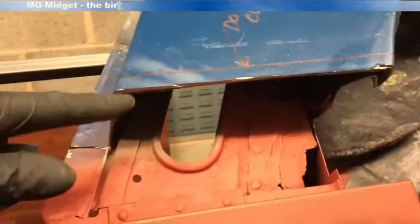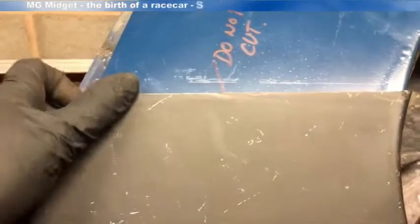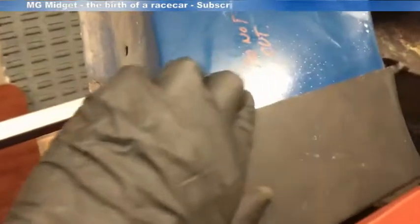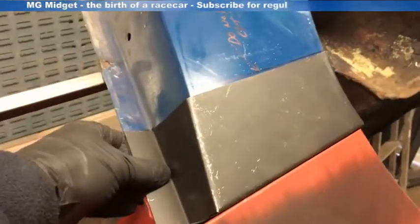Around the back end there's quite a big hole left here, so we're going to have to do a patch repair to remake the inside and seal that up. I've also noticed there's a bit of filler on this panel here, so I'm going to linish this back, and then this metal will sit on top of the metal underneath on the wing. I'm going to seam weld across there, then dress that back — it will require a little bit of filler for the step. So that's the plan of attack — let's have a go.